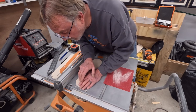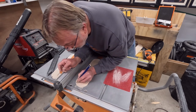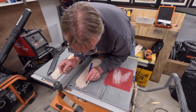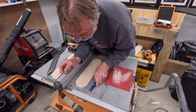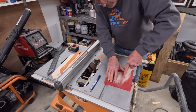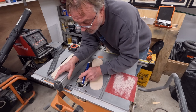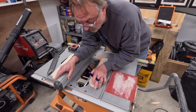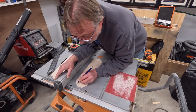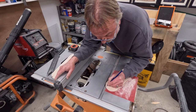What I like to do is set one end in and then take a good look at the other end and see where material needs to be removed. I can see we're just bumping a little bit through here, and we're looking pretty good over here but a little bit snug, so the whole thing just needs a little bit more right here. At this point I have it fitting pretty good. Now I need to cut a notch out of it for the set screw — it's just as easy to cut a notch in this throat plate and leave that set screw alone. So I'm going to mark it with a little line, take my jigsaw, and cut a little semi-circle right out of there.